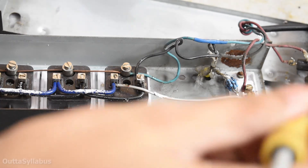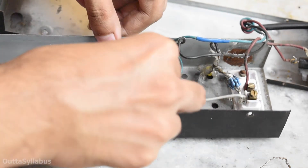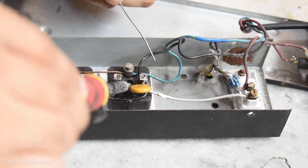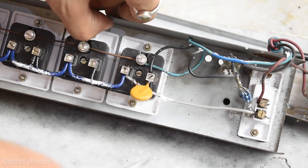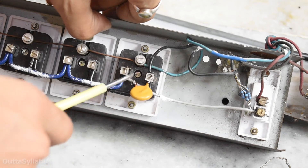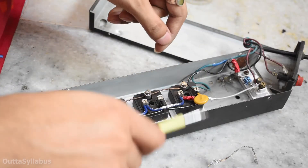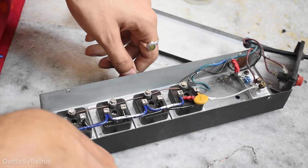For now you're stuck with this. You have to screw one terminal in there and the other terminal will get soldered with the bridge on the wire. Looks pretty neat to me. Still, you shouldn't cut slots or bridges in your wires because any loose wire can make contact. There are no loose wires in here, but I also have short legs for this MOV so we have to do it like this. This is not a very good practice. I've dressed some of the terminals — those are exposed — and now it's ready to be powered on. It still scares me a lot.